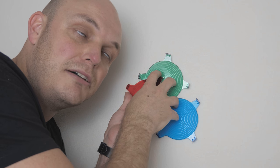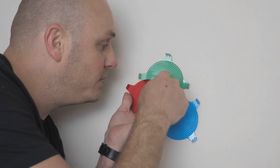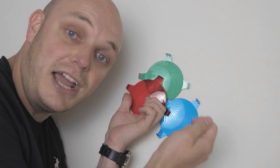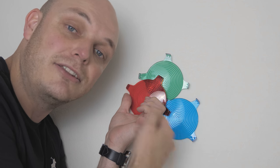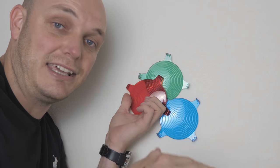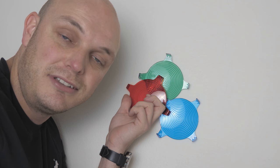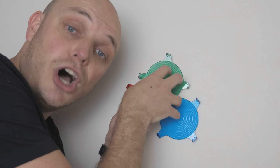Let's say the area that this dot represents is a tree, so the light is green. The green light will be able to penetrate the green filter, so the solar panel behind the green filter will produce a lot of current, indicating a lot of green light. That same green light will try to penetrate the blue filter but won't — it will come out black, completely dark, producing no current. Same with the red filter. So green produces a lot of current, blue and red produce no current, and that tells the computer behind the sensor that this pixel is green.